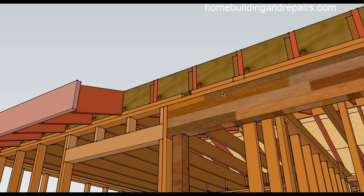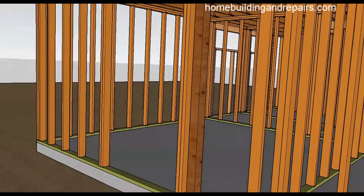Now if you leave the top plate alone and put the beam underneath it, you probably won't need to reinforce the connection or the tie — which is very important for the structure of the building. Any breaks in between the ties or where the walls go might require a strap, so I'm just going to throw that out there.